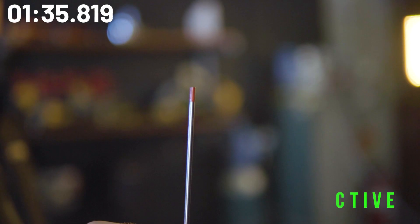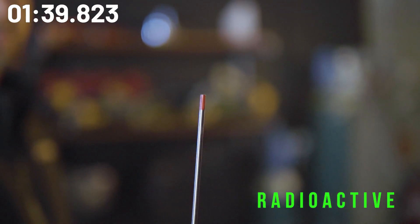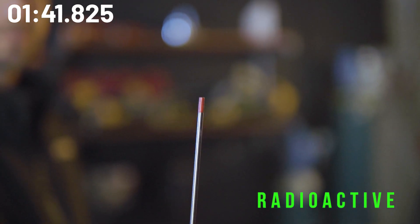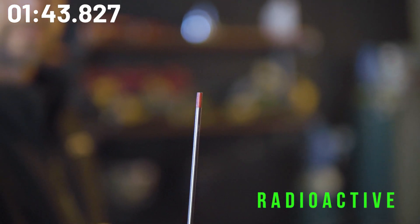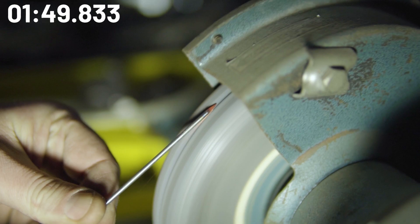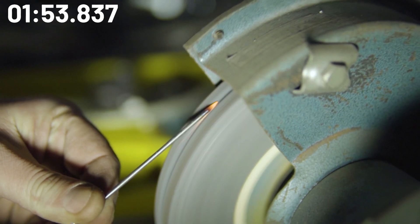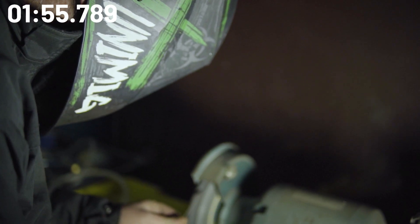When you're choosing a tungsten electrode, there's a couple of options. Thoriated tungstens, which have a red tip, are a go-to when welding on DC, but these electrodes are radioactive, containing 2% thorium and can be hazardous when sharpening. So the safer options are the grey-tipped ceriated or the gold-tipped lanthanated. The electrode will need to be sharpened to a point on the bench grinder, same as if you were applying it to any other DC process.